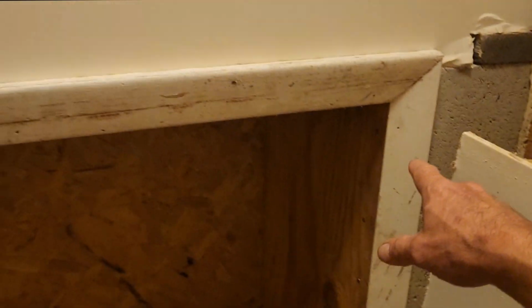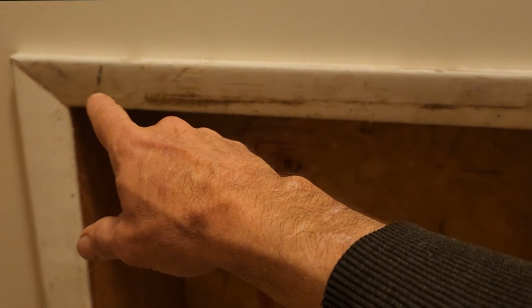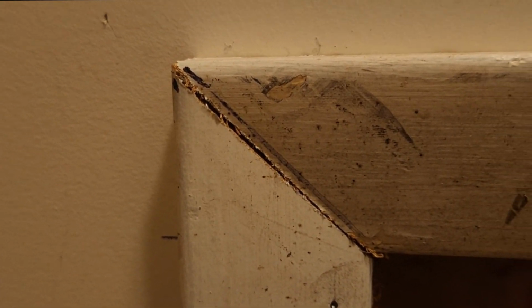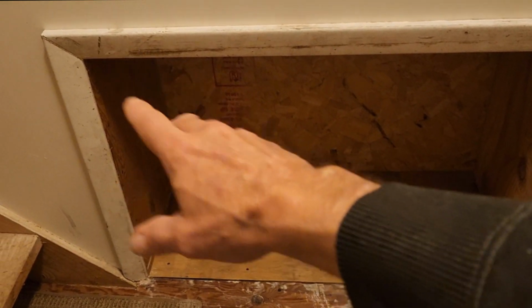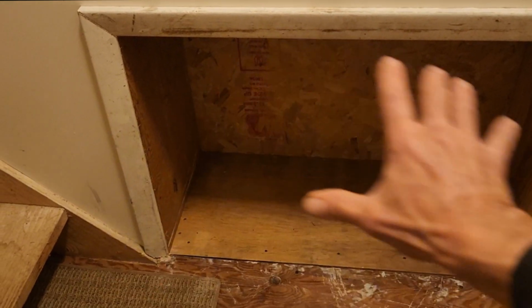But this is all just 3/4 inch plywood, and it's solid. And then out in the barn, there was pine moldings, and I mitered these just using my jigsaw. I don't think you can get any more perfect of a miter using that type of a tool than that. But I finished it off by framing it in with the pine moldings. And then this will, like I say, get a new floor, and then we can paint in there and everything. And this will be all finished off.